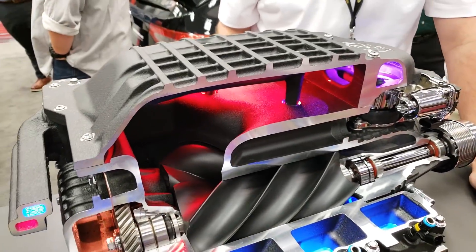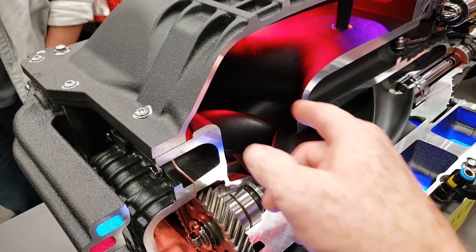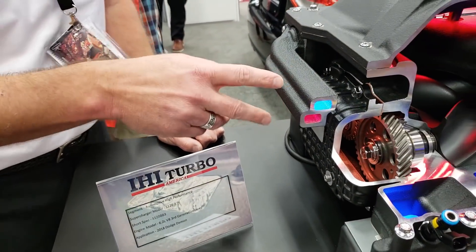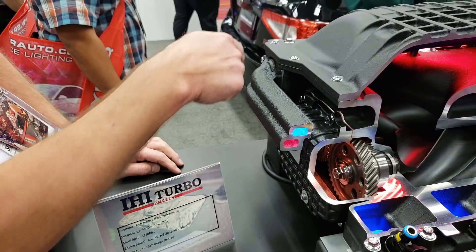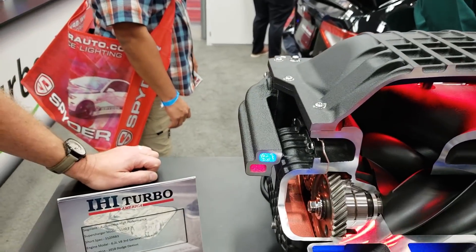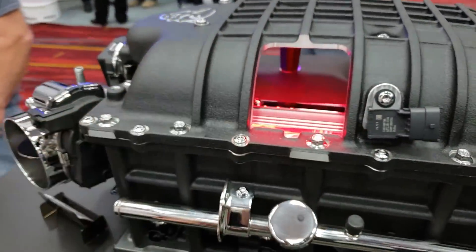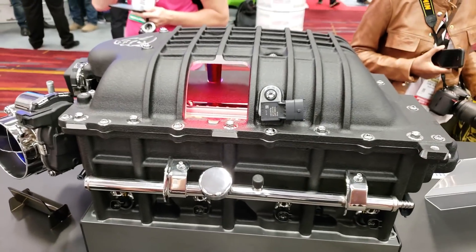So the back one turns faster and it's the male of the two? Yes — you can see it's really sharp and it's the one being driven, so that's the female and the male is on the back side. And then you see the gears back here — you'll have an oil bath inside on this side. What am I looking at here? You'll see the two different color lights — this is the intercooler. So your cool liquid from a radiator comes in, comes through here, runs through. There's another piece that comes out this way — this is red because it is hot coolant going back out. This is the cool coolant coming in to cool it. Hot air comes through the intercooler — that's the aluminum heat exchanger where it absorbs heat from the newly compressed air. When you compress things they get hotter; when things expand they get cooler.